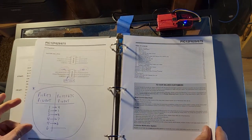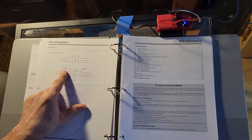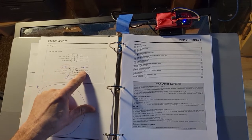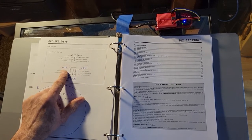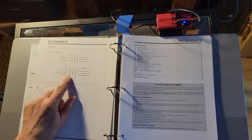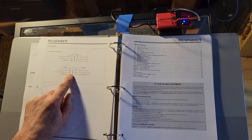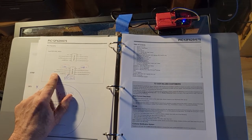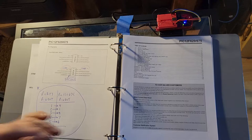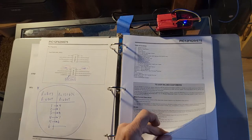That little chip has eight pins. Pin 1 is 5 volts and pin 8 is ground. There are the other six pins that can be used for whatever you want. We're actually going to use pin 3 for our output. We'll output a high and a low to turn on and off an LED. That pin is called GP4, or General Purpose Register 4, which is related to a bit in a register somewhere — I'll explain that later.